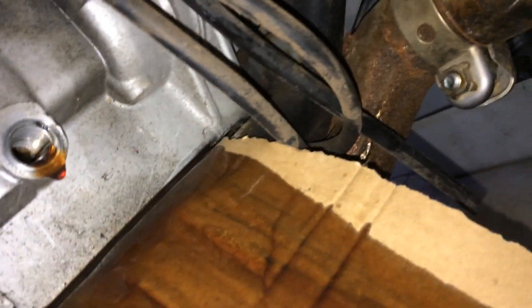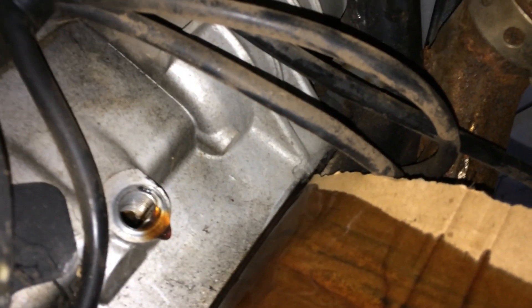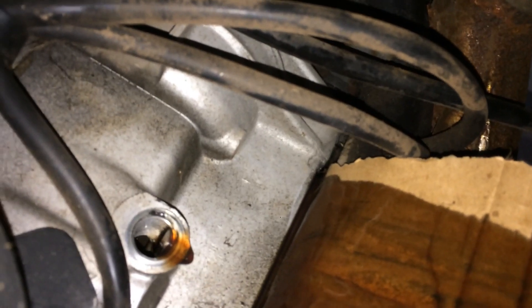It's a bit of a bear to get to because it'll drip everywhere, so put a little cardboard ramp. The oil was a lot darker and showed a lot more wear than the final drive oil — it came out kind of blackish red. So I put a little bit of fresh oil in there to just let it rinse everything out and let that drain too. Then I'll top it off, and this is 375 milliliters as the final volume for this.